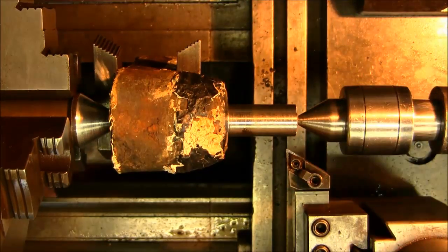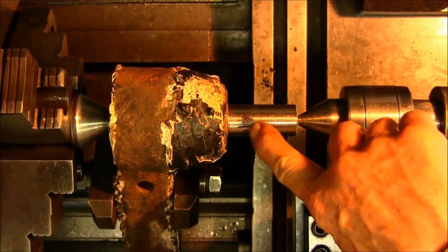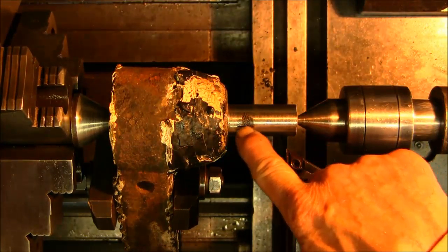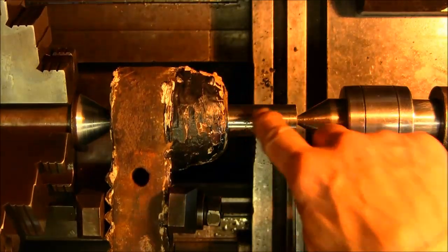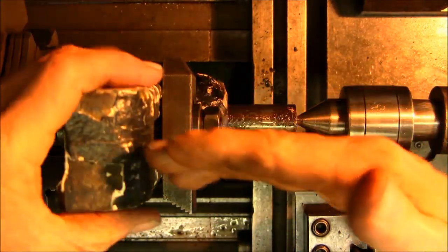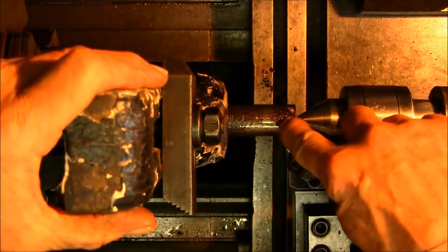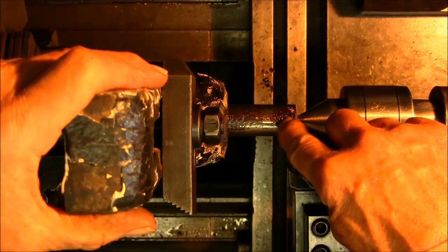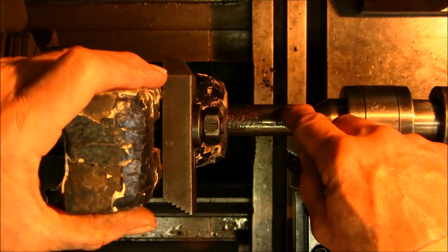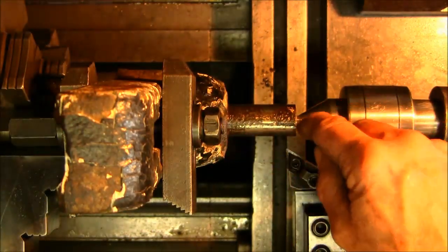Alright, and this is the pressure side right here. We do have one little holiday right in there, and I've mic'd across there, and we're only getting like one. There's a gouge right there, a ding, and we're not going to worry about cleaning that. Now we're coming up here. Now we're at the top. When it's in position right there, this never has pressure against it. This is always to the upper side, and that's why it's rusted and pitted in that area, because moisture is there and it's never sitting tight against anything, and it's always an air gap.